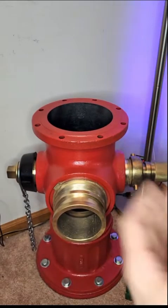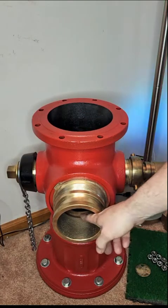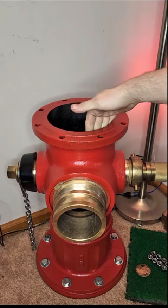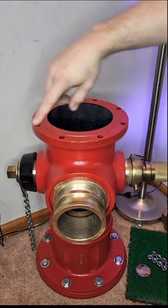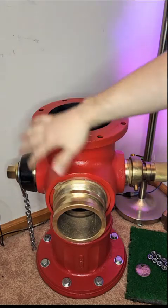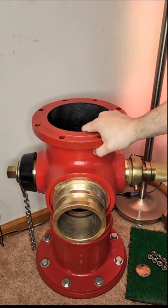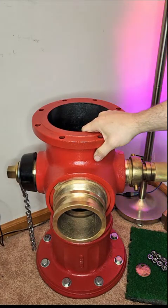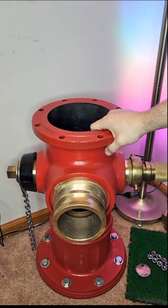When it breaks away properly, there's no force pushing down on that valve — it stays seated and no water comes out. The only way water escapes is if the valve seat gets cocked to one side during the accident. Apparently kids like to open these and throw rocks or debris inside, which can get stuck in the valve. To replace the valve you shut the main water line, then use a giant T-handle tool to unthread and replace the valve from the top. This particular fire hydrant head weighs about 200 pounds; the whole assembly weighs close to 600 pounds of cast iron, valving, and brass. Hopefully this video gives you an inside view of how a standard fire hydrant works — thanks for watching.